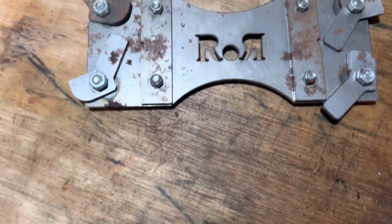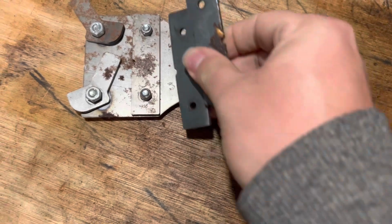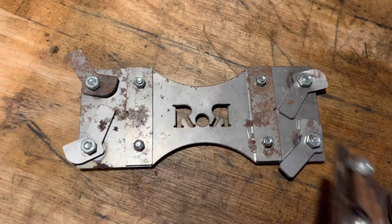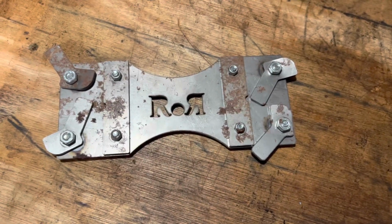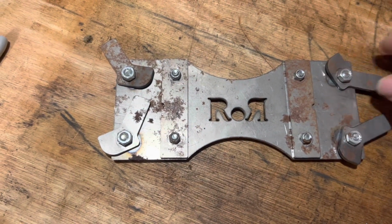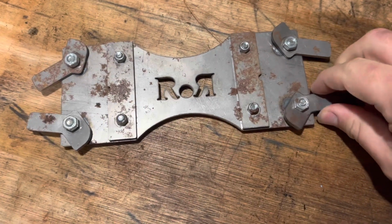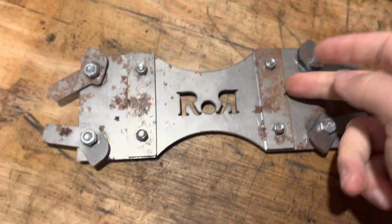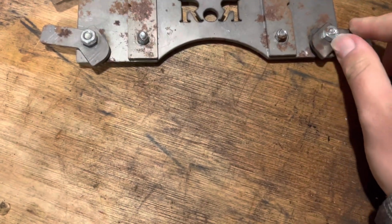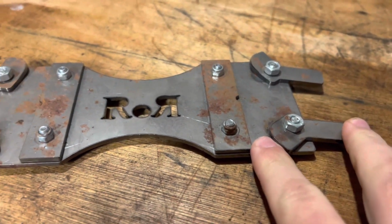Use the Ride on Railway track connectors, which is what these are. These are spare of these plates. These are slightly rusty, but they are just mild. There's nothing special about them. But they work really well. Essentially, you swing these round to the outside. These have got a bit of movement on them. You push the rail up to these plates. These are slightly bent up as well. And you basically clamp the foot of the rail under there and then do these down.